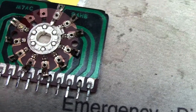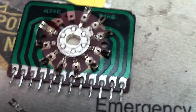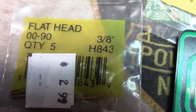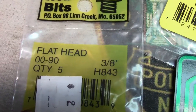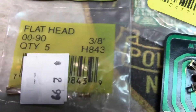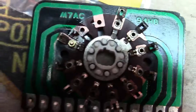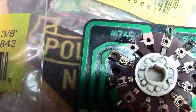Once you get them drilled out, it's very simple. I went to my local hobby shop over the border in Easton, PA, and picked up some flathead screws — three-eighths inch, size 00-90 — along with the nuts and washers for them. The reason you're using such a tiny screw is because I don't have a pop rivet gun small enough to rivet these back on, so instead you use a screw and a nut.